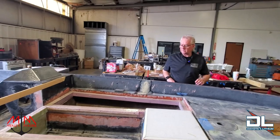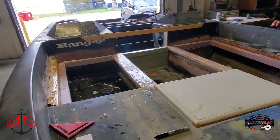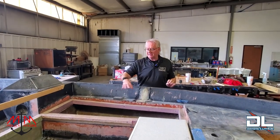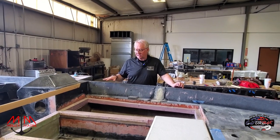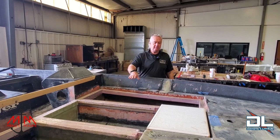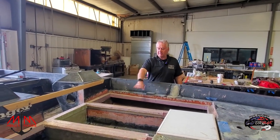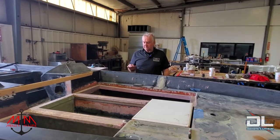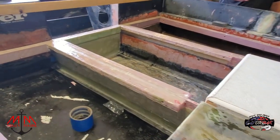We've been working on the reinstall. What we did was go around and lay a thin layer of glass on the top of the pink foam. One reason is we had joints and stuff — this layer isn't really structural, but we wanted to get everything firmed up. The 1708 is fairly thick and it takes a lot to get the epoxy into it. So we put a very thin layer of glass down — almost translucent — and epoxied over the top of it. We'll rough that up and then start to lay the heavier glass on top. We've also been going through with epoxy filler, filling in spaces. We put a thin layer of glass at the bottom to hold it in place and stop it kicking backwards and forwards.